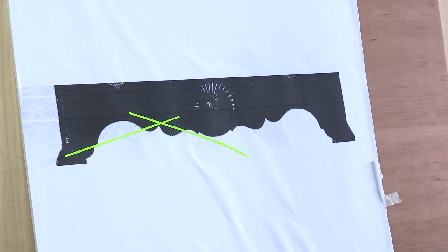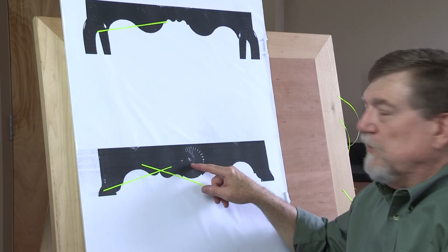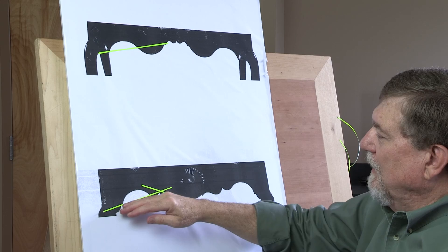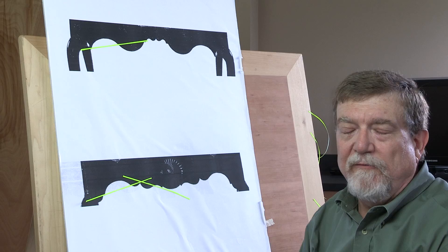The other thing that stands out when I look at these is the layout lines. This large one actually points up towards the carving at the center — there's actually a drawer there. And the layout line for the small cyma actually points downward towards the bottom apex of this arc. So instead of having layout lines going in the same direction, I've got layout lines that go up and go down, creating a flowing pattern across this composition. And for that reason I believe that's why this thing visually flows differently than the one up top.